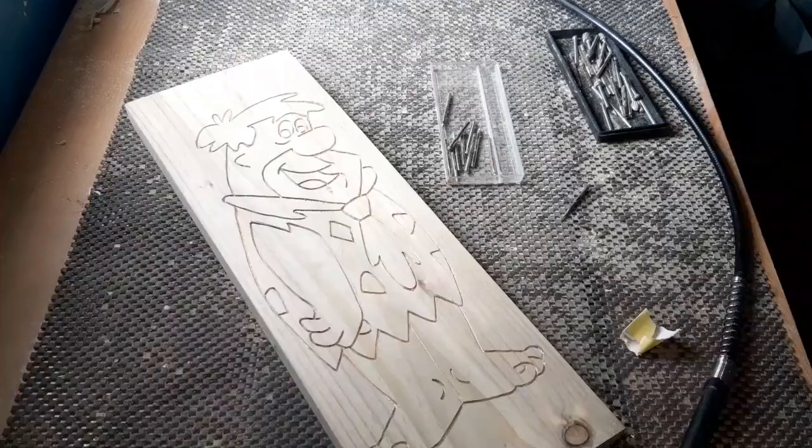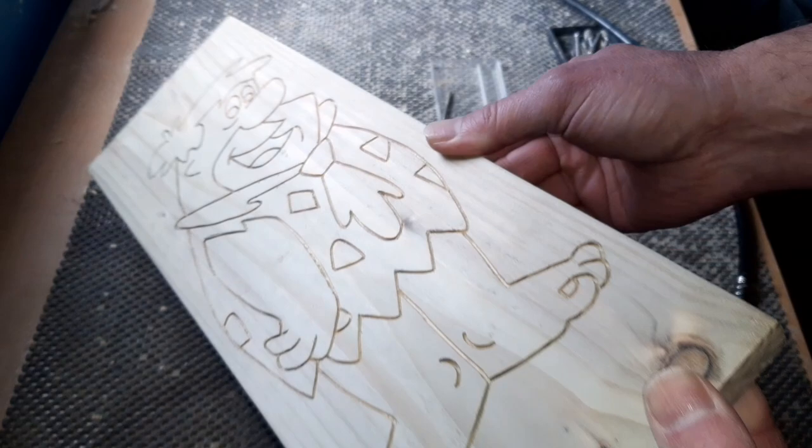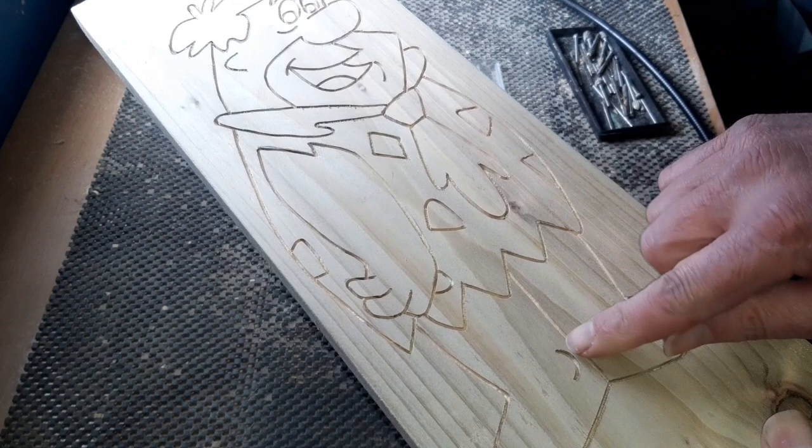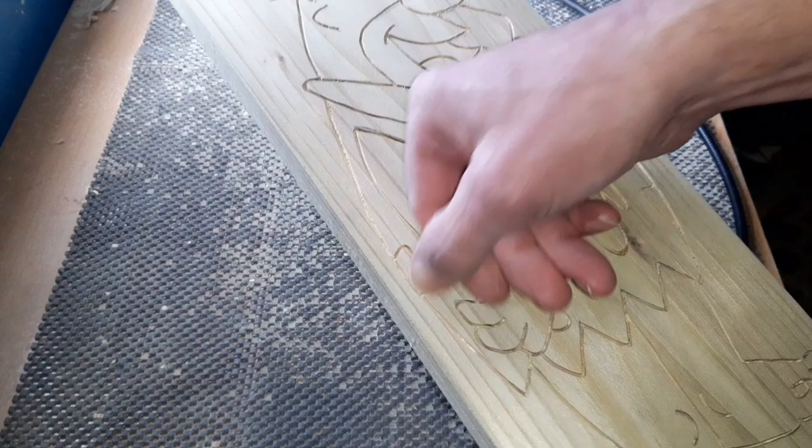You can see from that we've made it all the way round in one piece with our CNC bits — 20 degree we used on that one. That's fine, that's deep enough — a couple of mil maybe — just deep enough to hold the paint inside, plus it's enough that when we sand over the top we're not going to lose any of those finer lines. So that's plenty deep enough and plenty wide enough for our little project today.